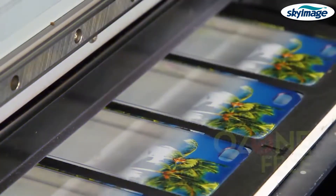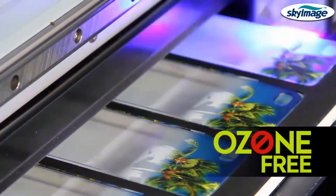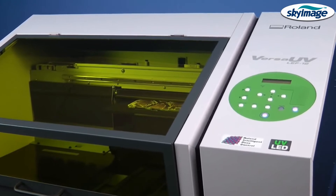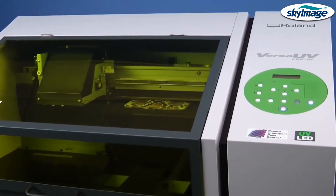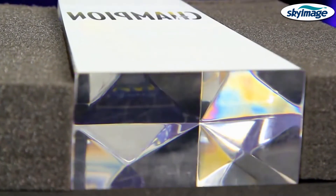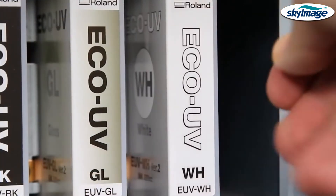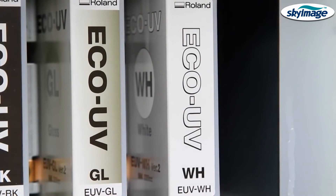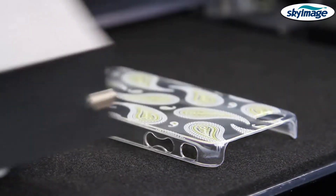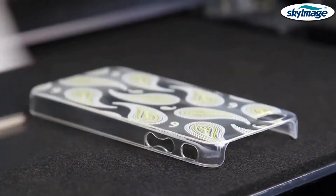The safe, low-heat LED lamp is completely ozone-free, and the LEF12 uses only a fraction of the power used by a conventional UV printer, saving thousands of dollars in electric bills every year. Our automated ink circulation system prevents the settling of white ink in the lines, significantly reducing ink waste and virtually eliminating all manual white ink maintenance procedures.